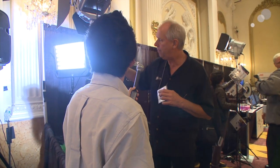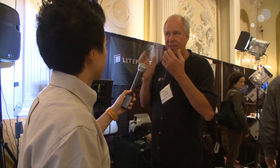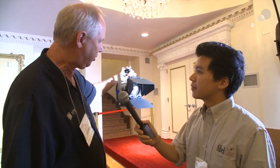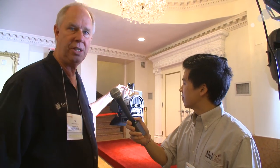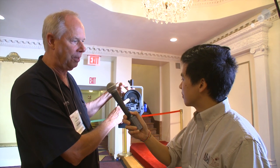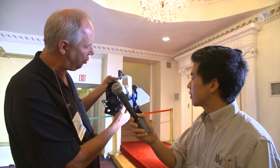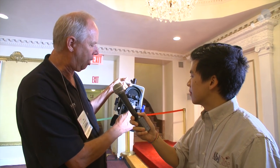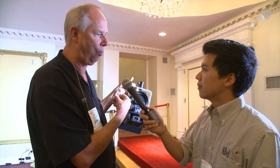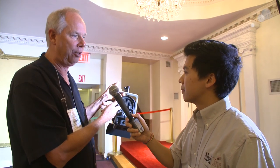It's very versatile for low-power situations. With this lensing, we've set them up in a perfect array — 10-degree beams with very nice lenses out of Belgium that allow the light to reach the point you need with a uniform flow. This is the Solar 4, a four-inch Fresnel unit, single source, single shadow, controllable. You have a dimmer for output and an encoder that runs a stepper motor for focusing. With DMX capability you can focus the light from flood to spot remotely from your dimmer board.